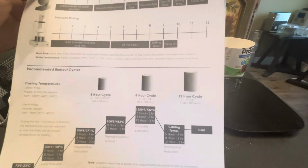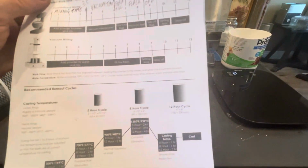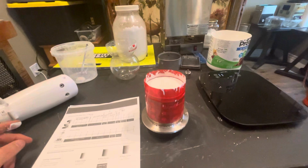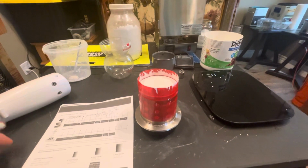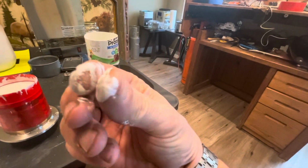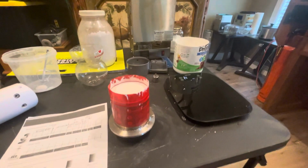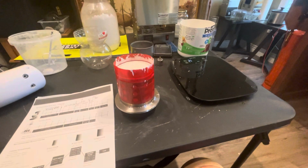That's the case whether you're doing epoxy or anything, really, that needs to set off. And yeah, the water should be 70, but of course it wasn't. It was cold. And maybe the cold contributed to the wax breaking too. You live and you learn. It's actually the first time I've ever adjusted water temperature. You can see this stuff setting in my fingers from the heat. That's why mixing investment with your bare hands may not be the best idea. You're adding extra heat, and boy, this is just taking forever to set.